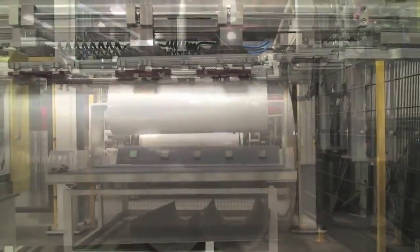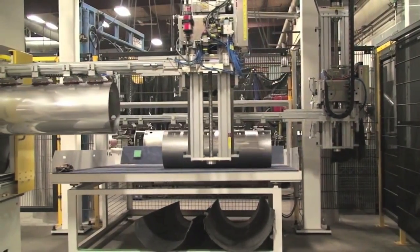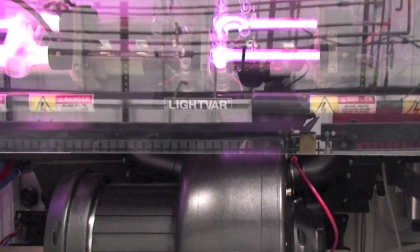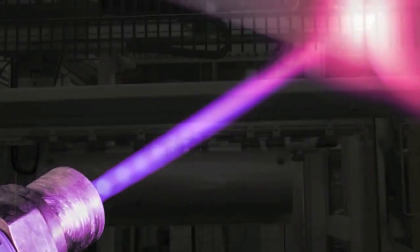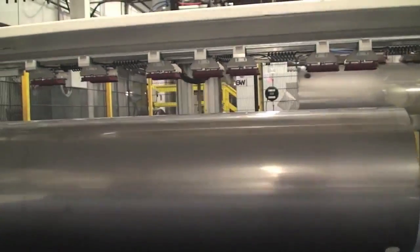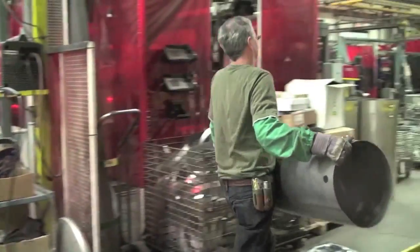The formed shell is automatically inserted into the weld chamber, where a D-mode laser beam focused through a bifocal lens welds the cylinder, resulting in an extremely clean weld with a very narrow bead. This process practically eliminates the heat affected zone and preserves the 316L stainless steel corrosion resistance properties. HTP's investment in this cutting-edge equipment will ensure years of plentiful, high-quality tanks from our factory.